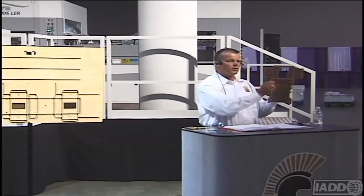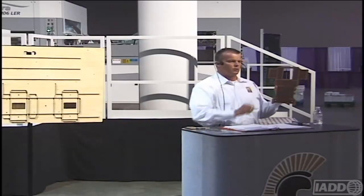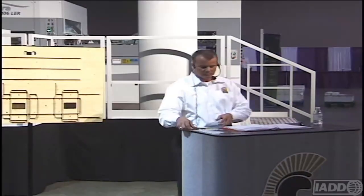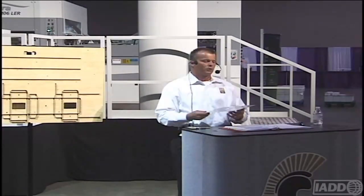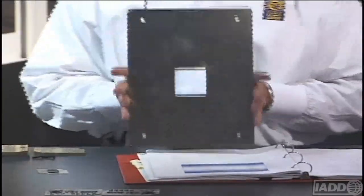You have to stay further away with your embossing plate to the score or the die cut rule. If you have a tighter tolerance or want to get closer to the score or rule, my recommendation is a steel counter plate.